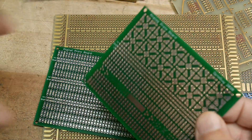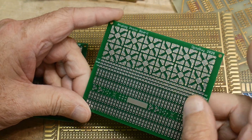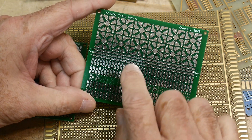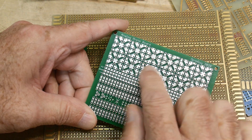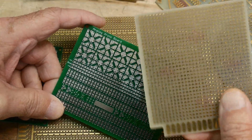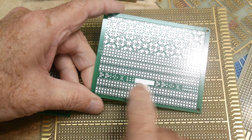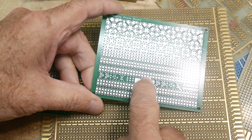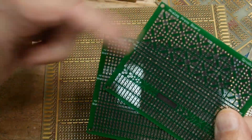Then I upgraded to an analog board. It has similar stuff at the bottom but is very different. This one has +V, -V, and ground. It has an area made for analog stuff with multiple point-to-point wiring - kind of like just holes everywhere but with some interconnects as well. Interspersed in here are some TO-3 packages, some surface mount packages, and a little ground plane area for dead bug style work. Both boards are on my share site - I'll put the link down below.